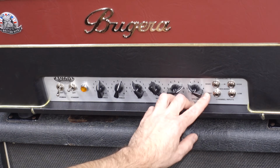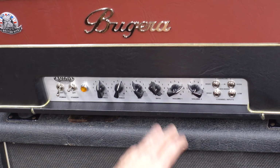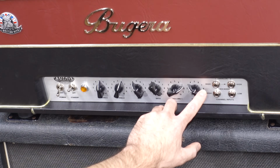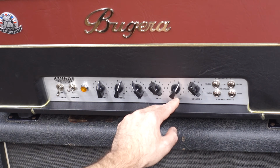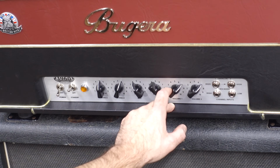But it has the mod on it, a Cascade mode. Remember, I've talked about the Cascade mod in other amps before. We plug into there and then it routes through the two channels. Here I have a schematic that roughly shows what's going on. That's the Cascade input. It's going to go through channel 2 first, the dark channel, and then the relay routes it around into the first channel, the bright channel. So this would technically be your main gain, and then this would be a gain blend. But again, it's two gains. You kind of blend them as you want.